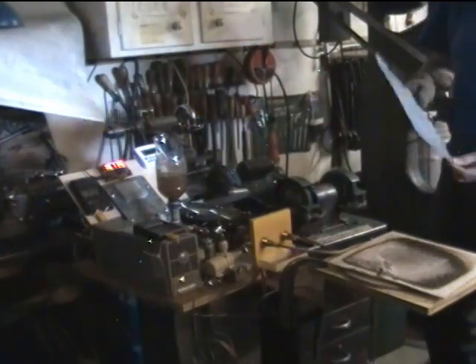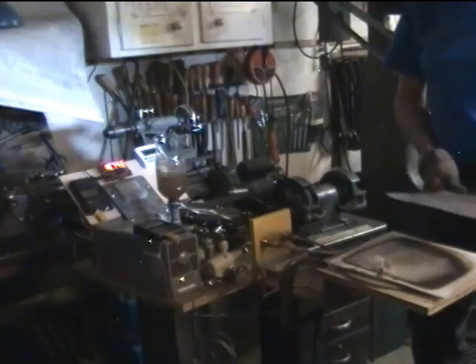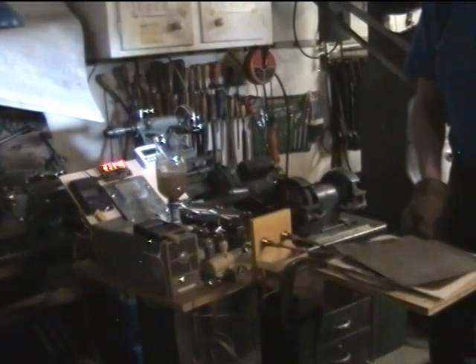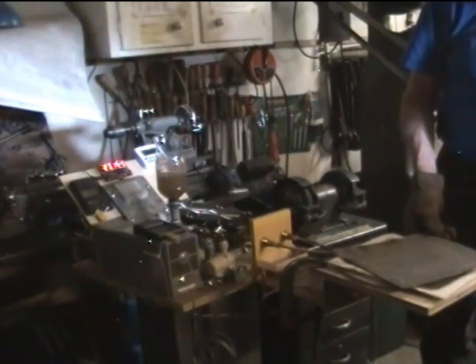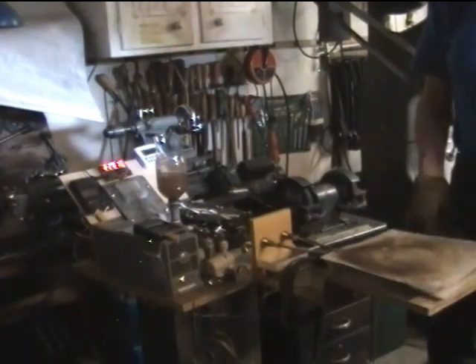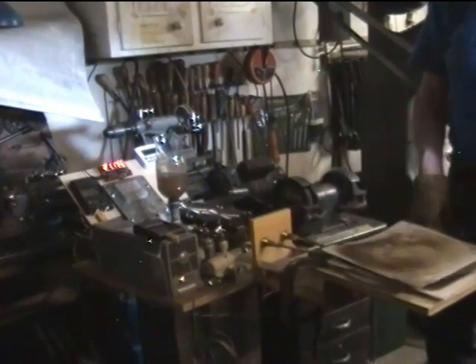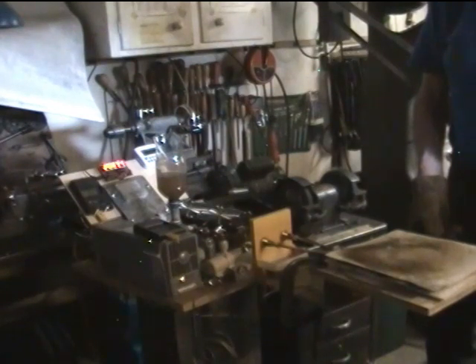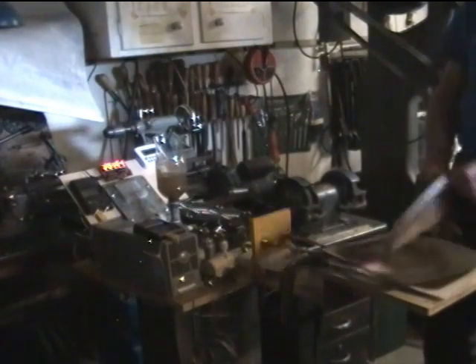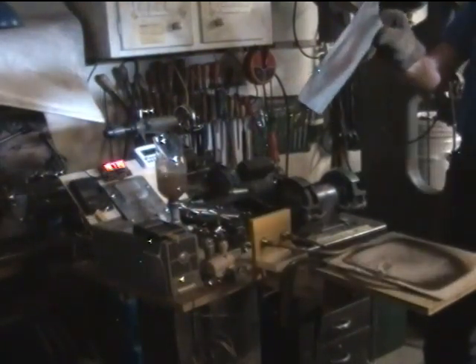The last piece I have here is a piece of galvanized iron — I probably should not do this, but I'm going to lay this on here and see what happens. Whoa — 50 amps easily, settling at about 45 to 52 amps. 10 seconds in, 20.6 kilohertz, starting to glow on the edge there. I don't need any zinc fumes, so I'm not going to go any further with that. But this is like 20 or 22 gauge — that heated up pretty quick. I just don't want any more zinc in the room.